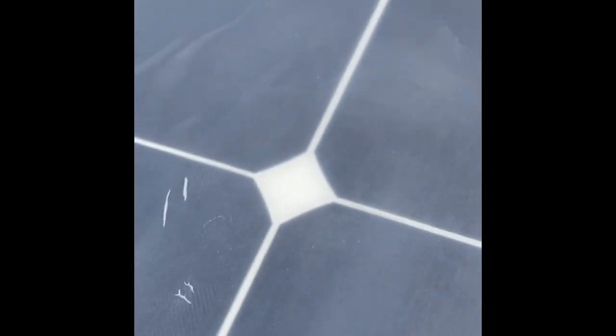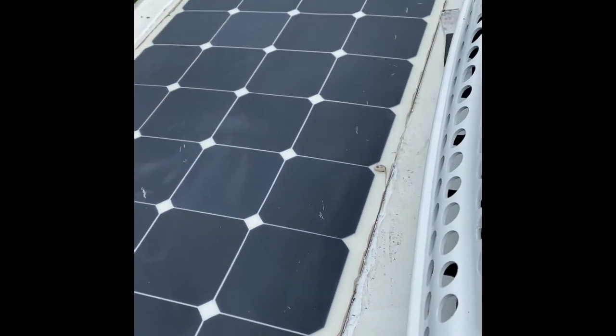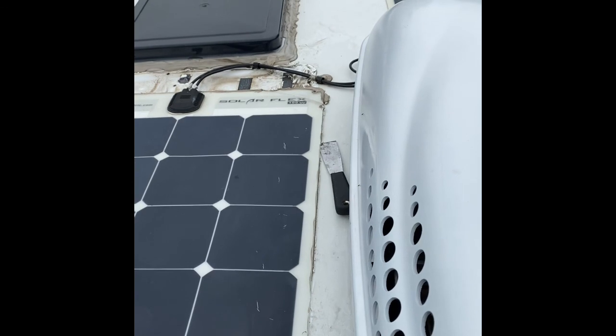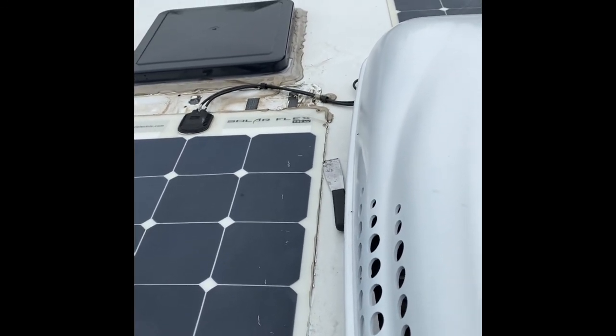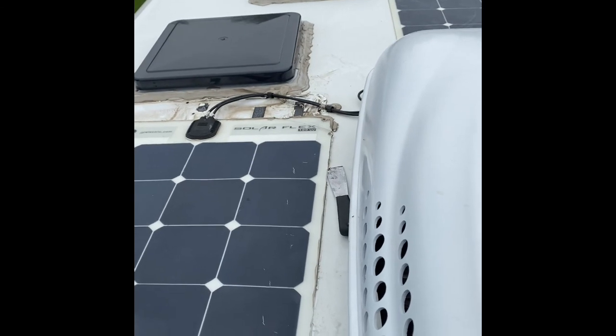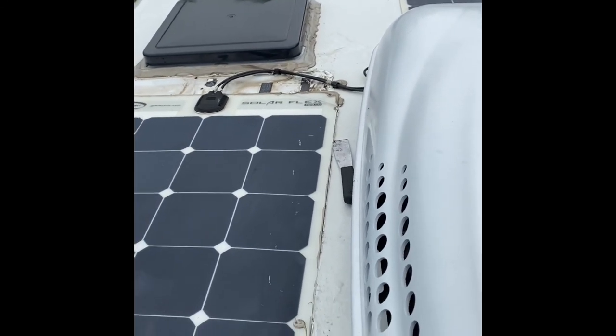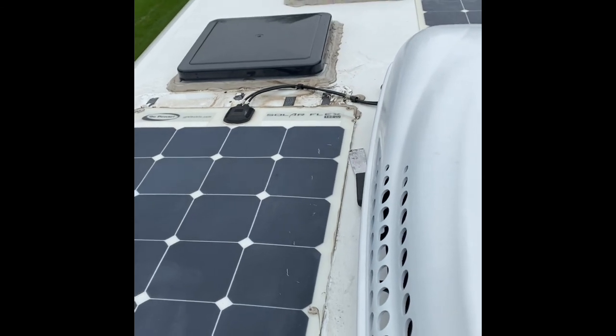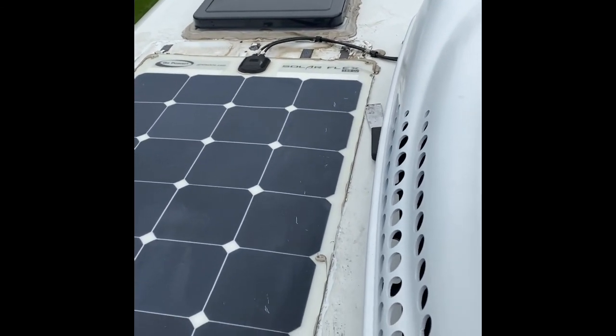The only thing I've noticed is in an effort to save these panels, taking them off, I have caused some damage. You can see those white scratches in there. I don't know how that's going to affect the power output. I'll measure that once I get these things actually detached. That'll be one of the next steps: I've got to unscrew the connections into the roof where that's holding down the wires, and undo the MC4 connectors on these things. Looks like we might have some rain, so one of the reasons I haven't taken those things out yet is I'm not ready to have to worry about the holes in the roof in the rain. If I can get these things off where they're just laying here, that'll be enough for now.